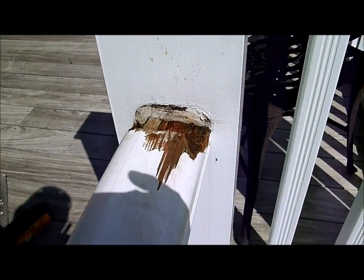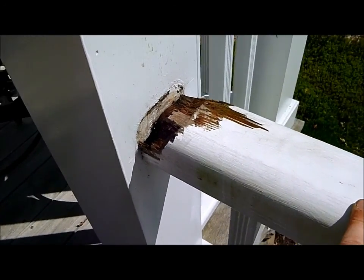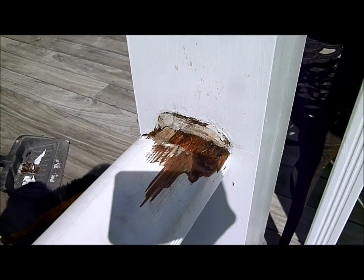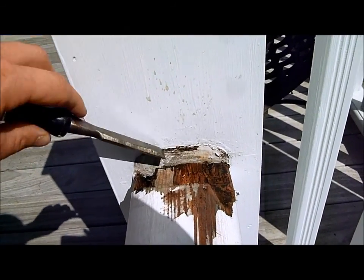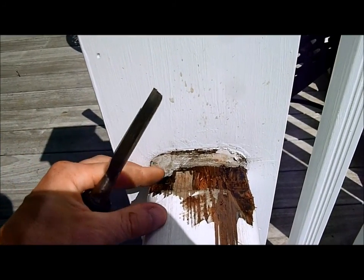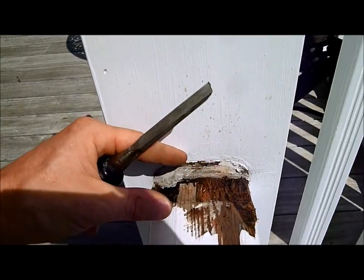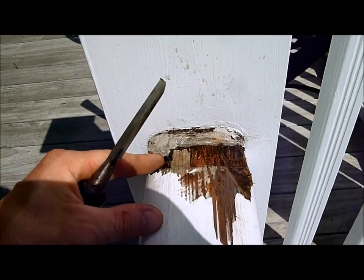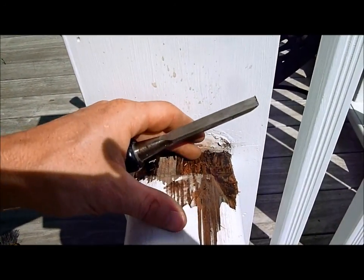Here's a pretty common problem: a bit of custom railing built using cedar, which is supposed to be rot resistant, but as you can see that's not always the case. I've taken a chisel and scraped out what was essentially dirt at this point. What happened was these ends soaked up water, and even though they were primed, sometimes a knot or defect in the cedar causes it to soak up water like a sponge.